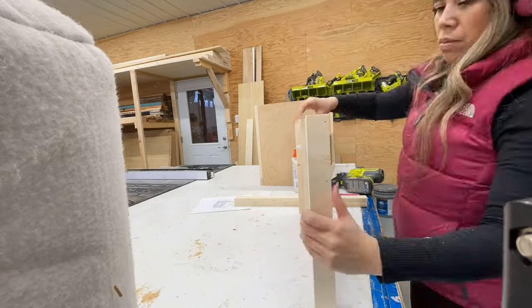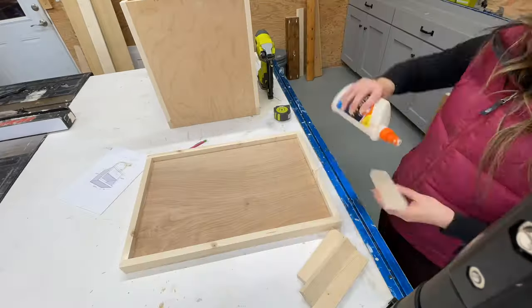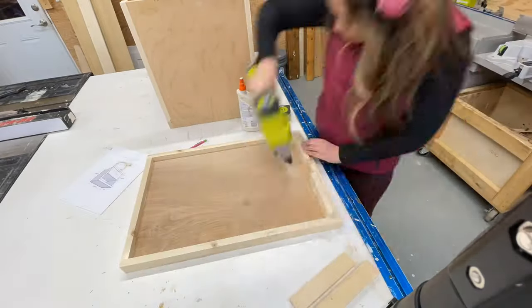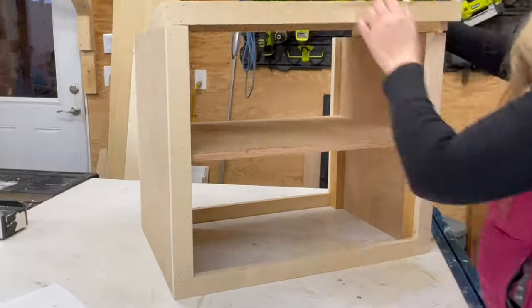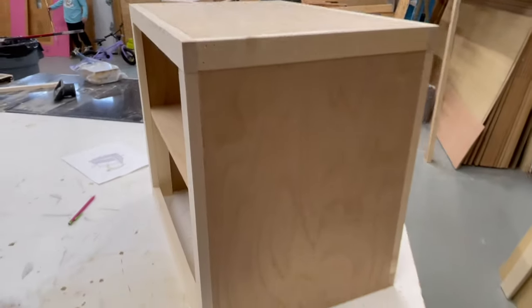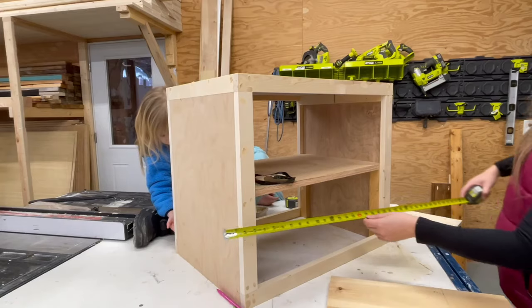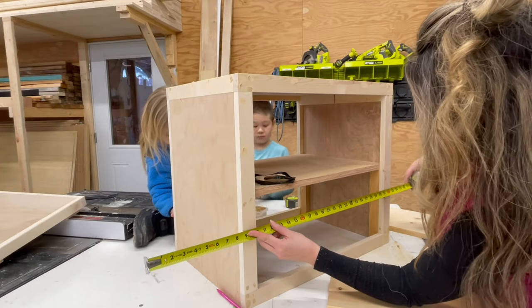For the top piece, I took the plywood piece and framed it with 1x2s. You don't need to do any edge banding on the plywood in this plan because all of the edges are covered with 1x2s. There's just a little cleat that holds it in place. I'm not going to attach the top yet because I want to remove it to do the finish.